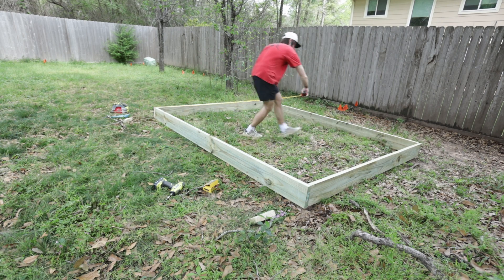Now we're moving on to what our foundation is going to sit on, which is this four-by-four post, and this fits perfectly in the Tough Block. Make sure you get a notch going. We're going to be starting with this side of the deck which is the highest point, lifting up only a little bit. This is three inches, and this is eight inches which is the height of my joist right here. The joist is going to sit on the post, so make sure it's not just connecting to your hardware with hardware holding it up — we're going to lift it up a little bit and then it's going to sit like that.